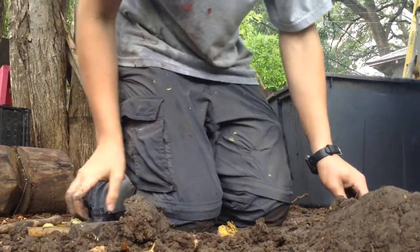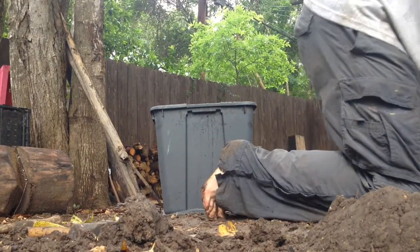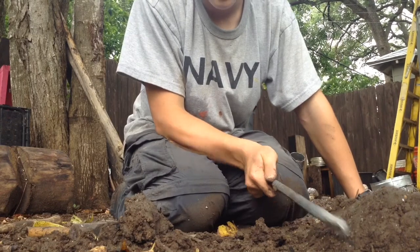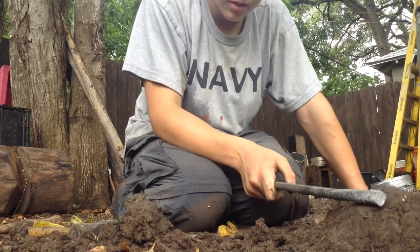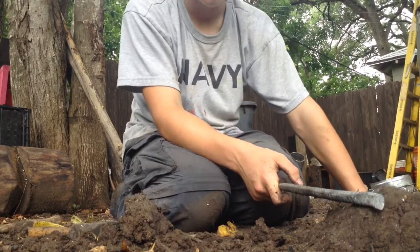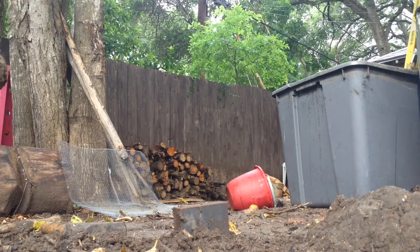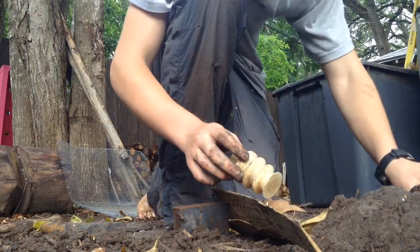For some reason my charcoal isn't doing well. I think charcoal blocked the path of the blower — that's why it really wasn't working. Running a charcoal forge, I guess you gotta worry about ash. Didn't even think about that. Bigger the pipe, bigger the charcoal, because you don't want the charcoal to get all ashed up in the blowing tube. The wood burns into charcoal, charcoal is your smithing fuel. So I'm gonna see if I can get that to work.